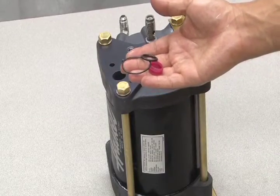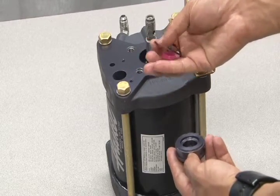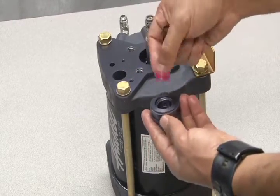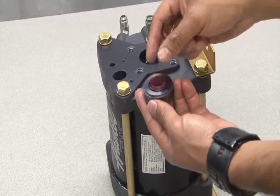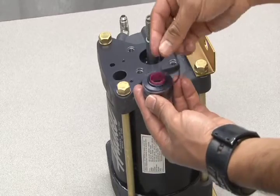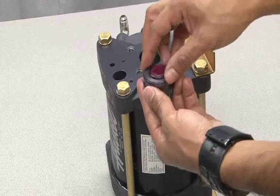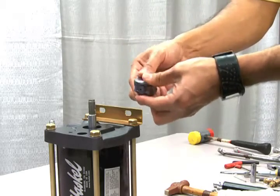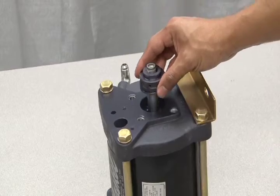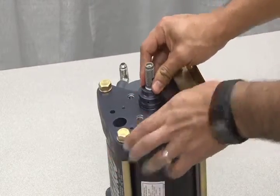Now replace the first seal packing for the piston rod. These parts will be included in your seal replacement kit. First, place the seal into the spacer. Next, put on the inner O-ring and the outer O-ring. Put on the other spacer. Now slide this assembly into the piston shaft and push down until it sits flush with the end cap.